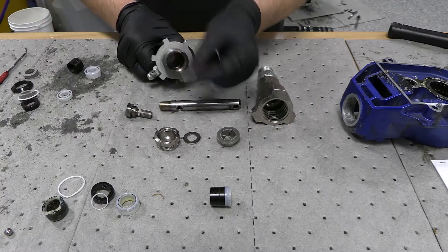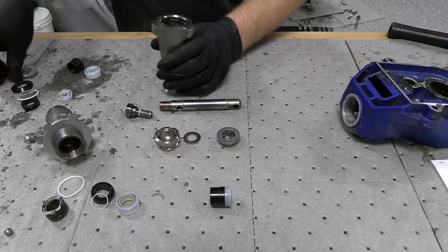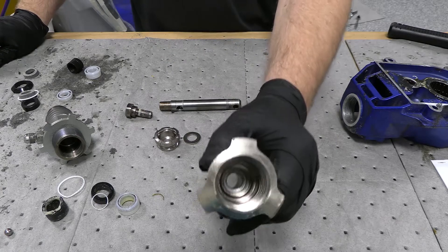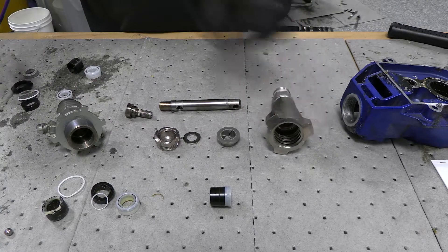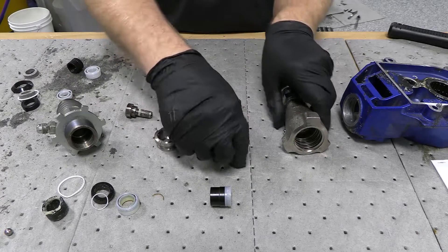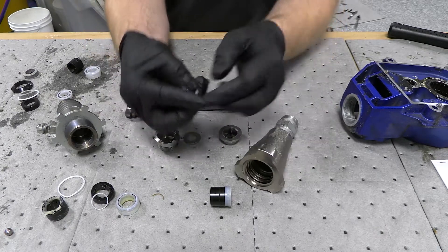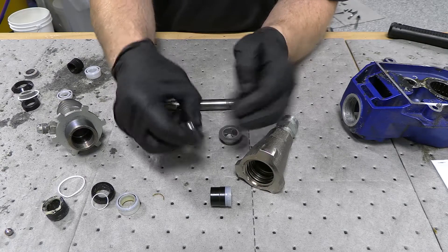First thing, put my Teflon washer back down in the bottom — it goes in this one. Make sure it's seated where it's supposed to be. Again, very, very small, kind of hard to see down in there. That is the piece that this seat goes on top of — that's the seal in the bottom of the pump to keep liquid from going out the bottom of it. This seat is double sided, either one will work, and that's what that check ball sits against. So that has to be a nice fit. If there's any liquid that could leak by those two, your pump is going to leak and not build pressure.